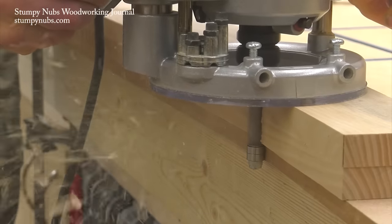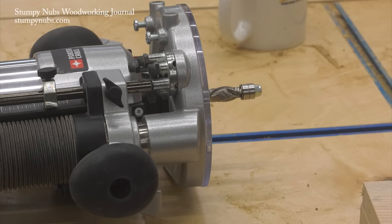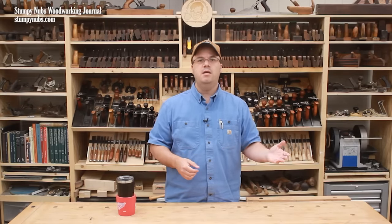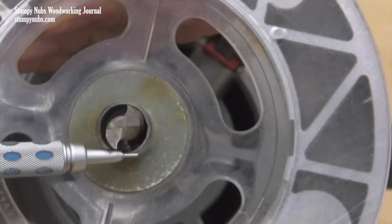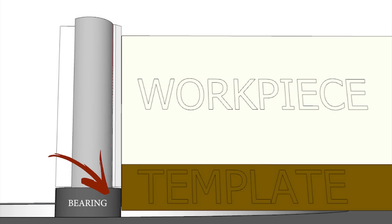On the other hand, suppose you wish to trim an edge flush with an adjacent surface. The bearing on the end of a flush trim bit is uniquely positioned to make this possible, and its precise size ensures a perfect result. Such flush trimming is a common practice not only in countertop installation, but in many other cabinet making applications. Template routing is also much easier with a bearing guided bit because the larger size of a bushing creates an offset, forcing you to make your template smaller than the final product. A template bit makes template making much easier.